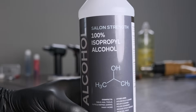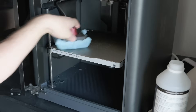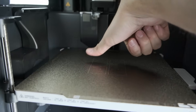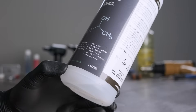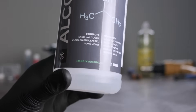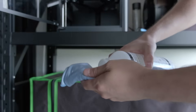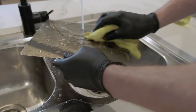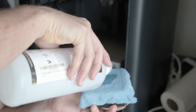Isopropyl alcohol. I use 100% IPA to clean my build plates between prints. It's great for removing tiny bits of leftover filament and light oils, but only to an extent. Even at full strength, it can still struggle to fully remove oils from your hands that have gotten onto the build plate. In a previous video, I tested this by touching the build plate in a number of spots with my thumb, printing over it, then cleaning with IPA and printing again. The marks were reduced, but some oils had been smudged around the center instead of being completely removed. I always use 100% because it doesn't contain any additives like bittering agents that can leave residue and lead to poor bed adhesion. It's also worth noting that overusing IPA can wear down your PEI surface over time. That's why I recommend giving your plate a proper wash with hot water and dish soap every now and then to reset it. As long as you avoid touching the plate too much, 100% IPA works great for quick cleans between prints.